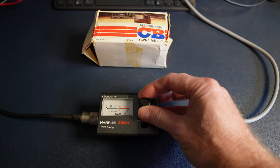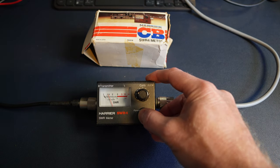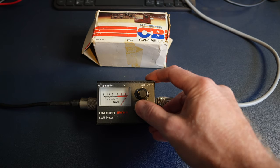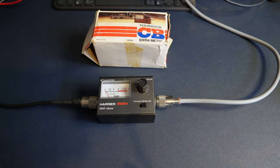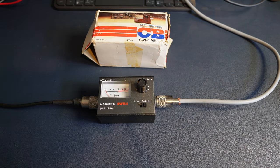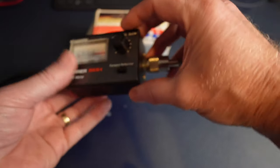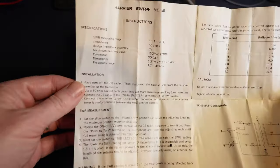Let's have a little look. Yeah, chucking it down — one to five there. That's not bad — that's on the beam, actually on that three-element beam on 10 meters. The way I've set this up it's between the 10 and 11 meter band, so it's a bit of a compromise, but as you can see this is working fine — 100%. The frequency range is 1.7 to 30 megahertz, 100 watts at 27 megahertz.